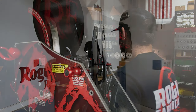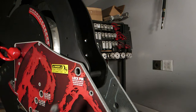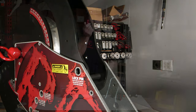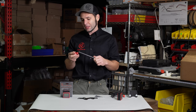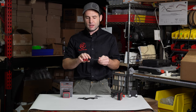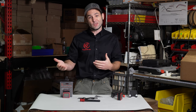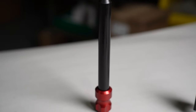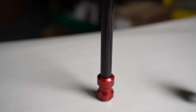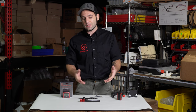The other feature is that the rod is Delrin — engineered plastic, about 10,000 psi — and it snaps. If that happens, you get to keep your made-in-the-USA billet machine knob, buy a new rod, throw it back in there. This plastic rod has become a fuse, saving your bend wheels from damage if you accidentally run the machine while someone is changing dies in it. That's critical for businesses, multi-operator machines, stuff like that. If you're running it by yourself and you're careful, it's not something you'd likely need.